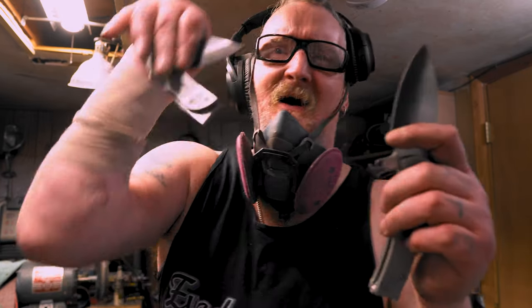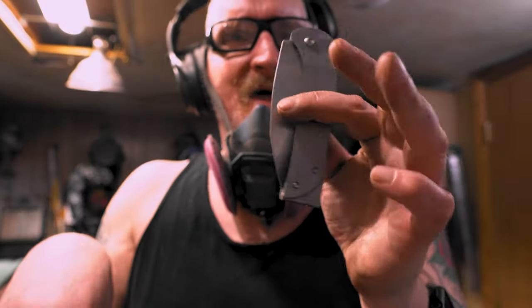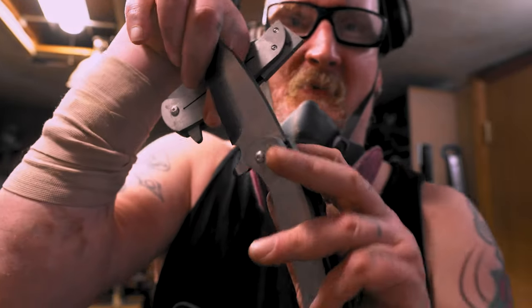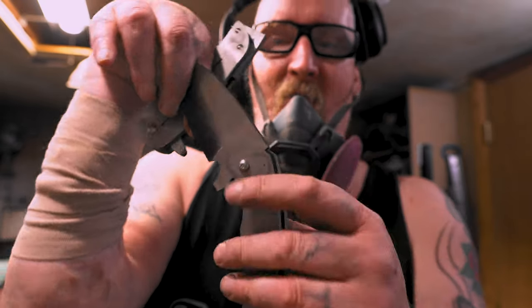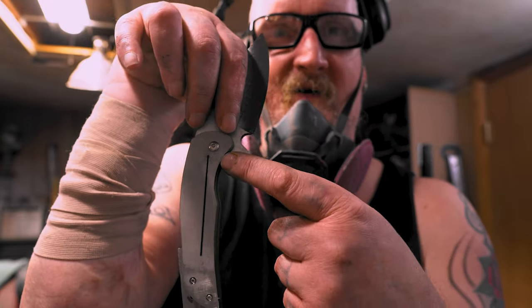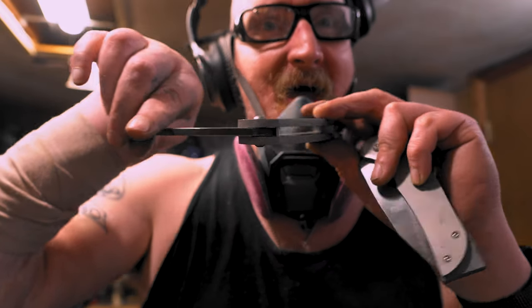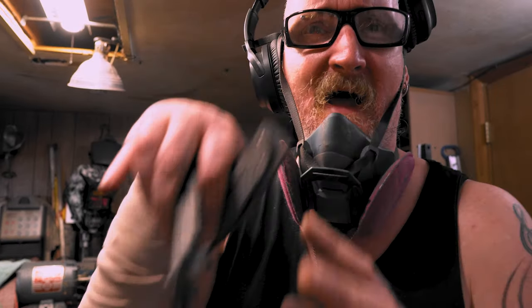All right, time to get back on these bad boys. Yeah, man. I went and got them out of temper and cleaned them up on the surface grinder, and then I went to the bearing races and had to hit them with a carbide bit because they're hardened. I went too far on this one, but I realized if I go a little bit farther and put a washer behind the bearing, it fits perfectly. So I thought I messed it up, but we got it down. It's nice and perfect. And time to clean these all up, do the backspaces and all that.